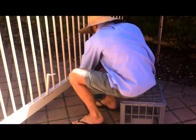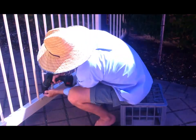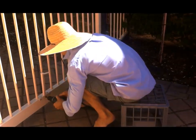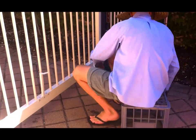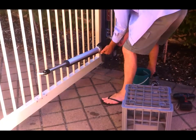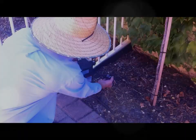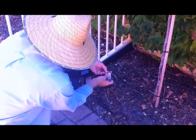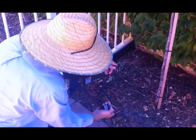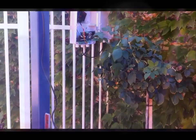I've taken that bracket away and painted it cream to match the gate, so now I'm putting that on. This is the permanent mounting of the actuator — I've dropped the pins in and put the clips in place. I've already connected the battery cable and the solar panel cable to the controller, so now I've got to connect the actuator cable into the electronic controller.